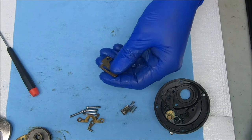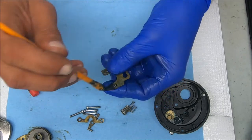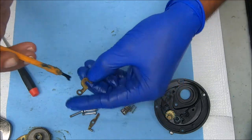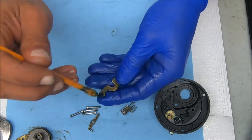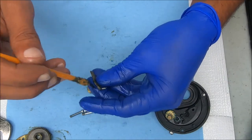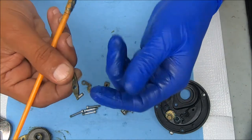All right, so now we can grease these pieces up so we can get this right side put together. The key for greasing is really just applying grease wherever there's movement or pieces that move from one piece onto another, or having some interaction with something. So if the pieces are moving, essentially, you kind of want to grease those things up. I'm greasing the dog itself as well, but not the end of it. And yeah, I did leave that spring on there.